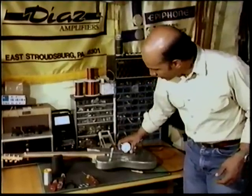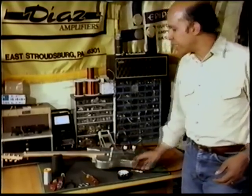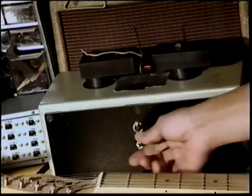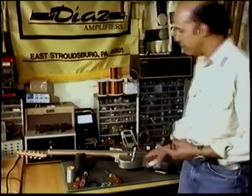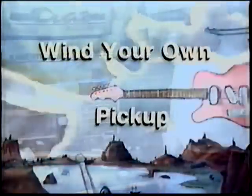That's really quite high. This is kind of low. If we had to take it out, all we would have to do would be to put it in between the magnetizer jaws, throw in the switch. Just 1 second, that would do it. We'll measure back, and we'll notice that, yes, it's full strength. It's a really simple procedure.